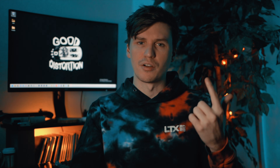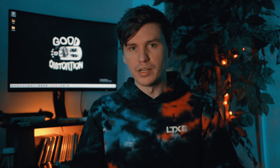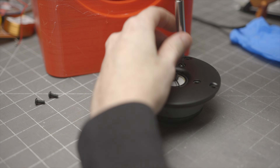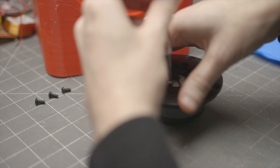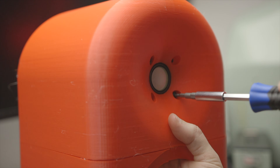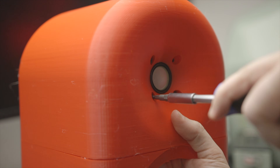You can take the two halves, put some silicone or construction adhesive all along the interior where they're going to join, push them together, and then put on a rubber glove and go through the inside to fill in any gaps, just to make sure it's nicely secured where the two pieces join. After letting that cure overnight, I came back and used a soldering iron to insert threaded inserts into all of the retaining parts for the woofer and the passive radiator. Once that's done, put a gasket around where the tweeter is going to be inserted to make sure it seals nicely. You can take the waveguide that comes with the tweeter off the front while being careful not to completely disassemble the tweeter — this coil is very fragile. With the speaker facing up, carefully insert the tweeter into the chassis and tighten down the four screws in a cross pattern. You don't want to over-tighten them, but get the tweeter snug and not moving.